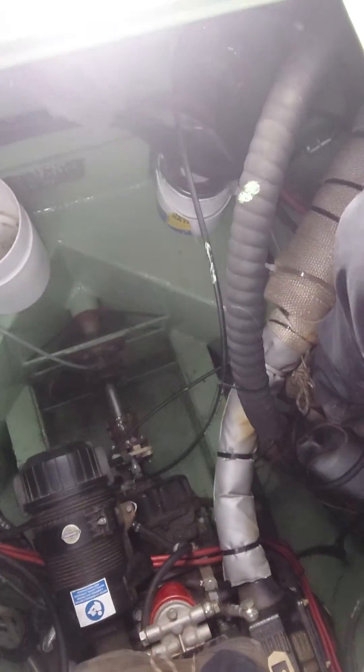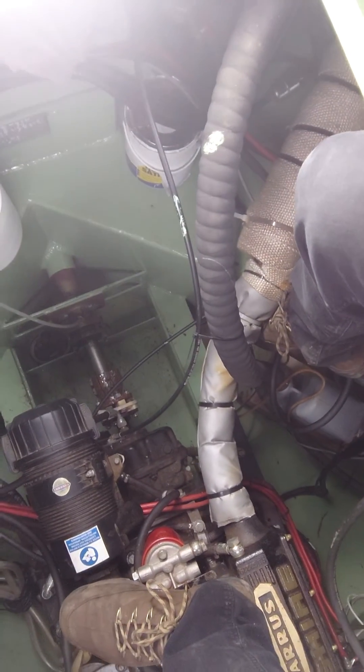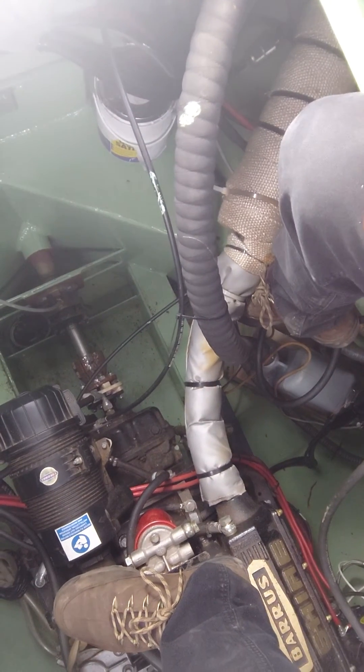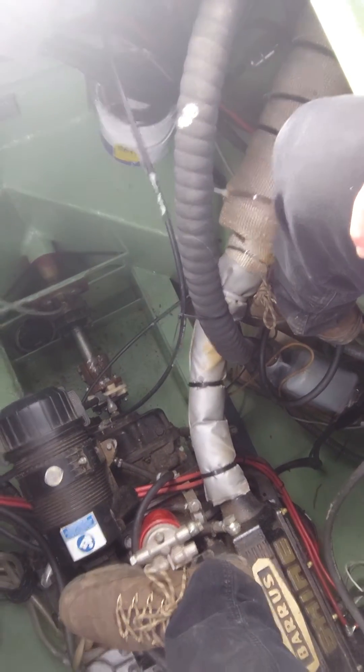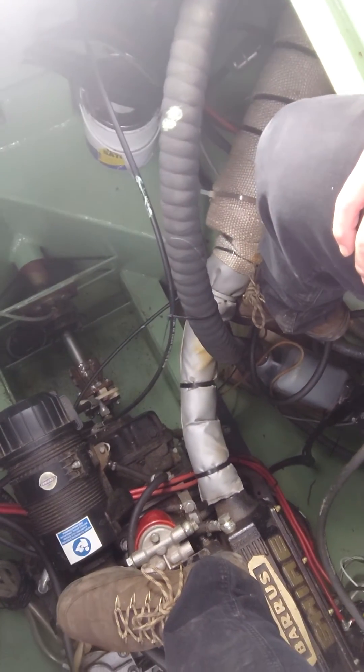So that's really important. I know this is a hydraulic box, but it will still do damage on a lot of boats if it keeps grabbing like that — especially with this boat. It's the best part of 18 tons in weight, so there's a lot of thrust being pushed onto the engine mounts on engagement.